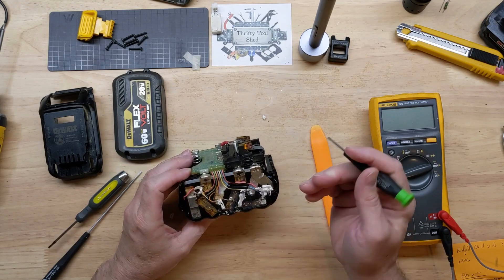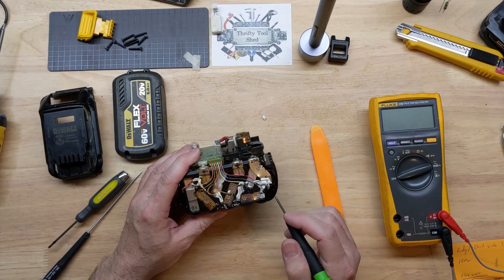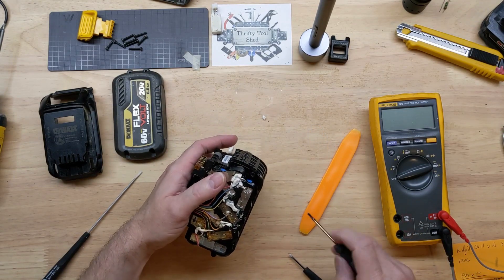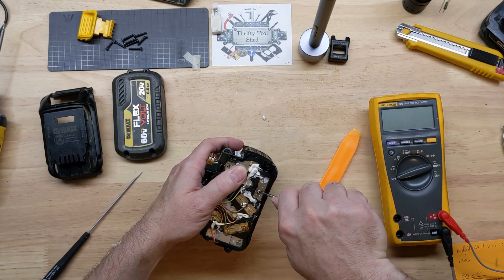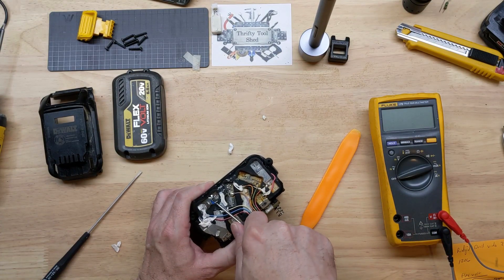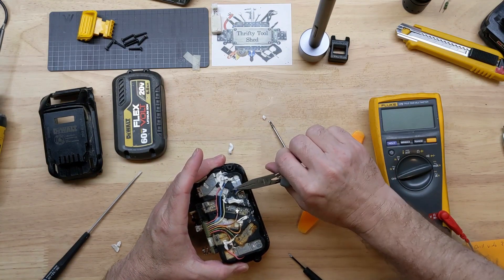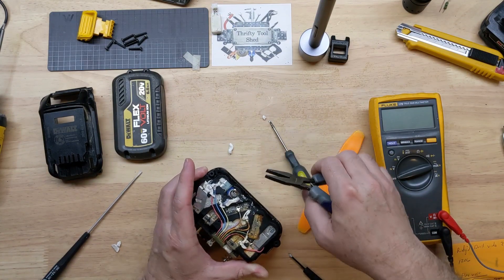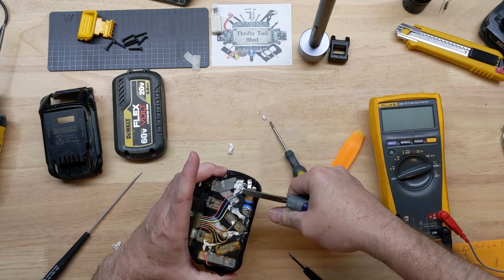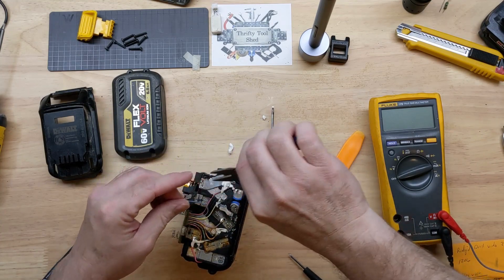Sometimes we don't have the power we need with plastic or non-conductive tools to get in here and pry, so we just have to be very careful. Some of these cells — and the battery — are still charged up to a pretty high level, and we don't want for any reason to come across any of these. Another thing to be mindful of is the metal edges. The way these break, they're always going to be sharp, so be extremely careful. It's hard to work with gloves on, but these things can absolutely rip you open.